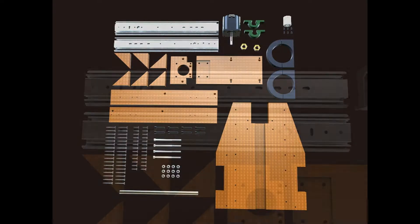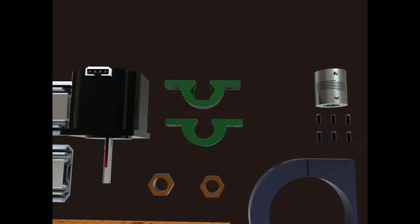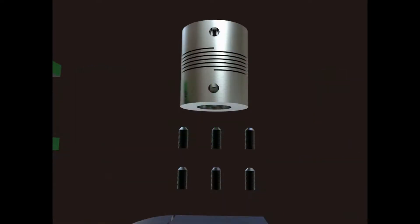Getting a little closer up here to show our drawer slides. Everything has been put back into a computer digitally. This is our stepper motor and our anti-backlash fittings, as well as our drive nuts. This is our coupling — it has six all-thread pieces that go inside. Those tighten down on the 12mm shaft, which is our drive shaft, and it goes into our 6.35mm shaft that attaches to our stepper motor.